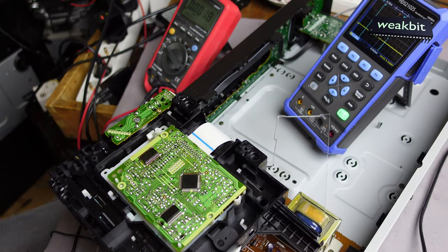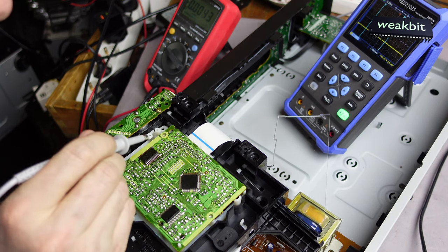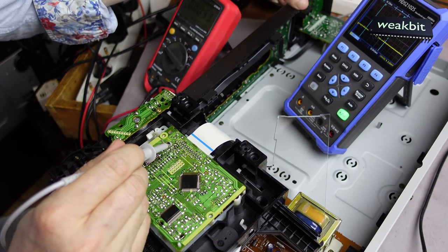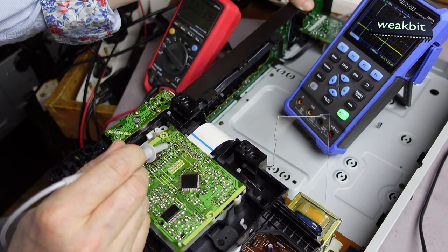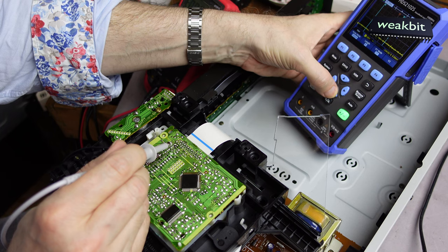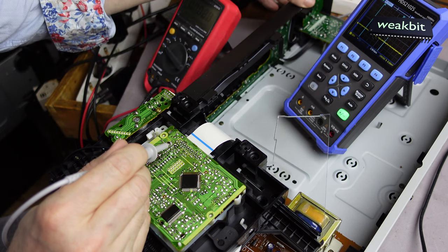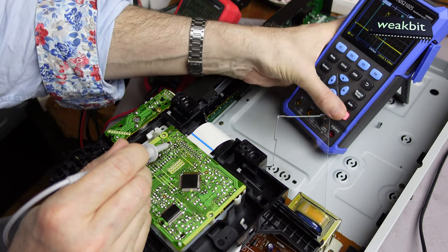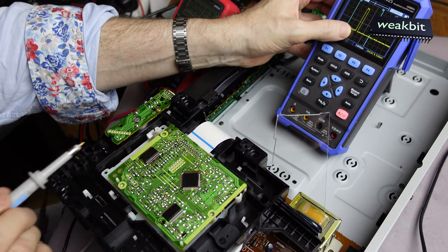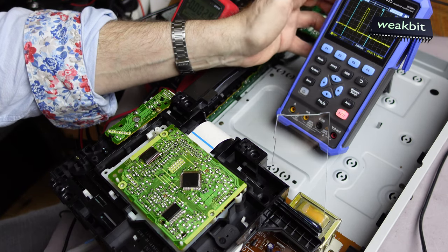I found the pins on the board for the sledge motor. If I turn off and turn on — 100 milliseconds interval is good — you see this pause: that's the sledge motor going forward and backward.